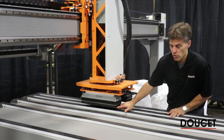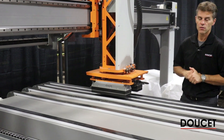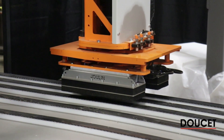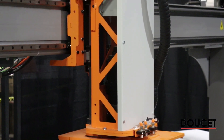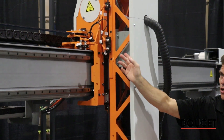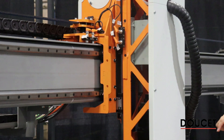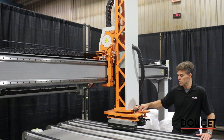We have the vacuum gripping head with our Joulin head — it can grip any type of part in any size. The system self-locates based on the piece sizes, centering as much as possible. Each axis comes with a servo motor. You can see the horizontal drive using a timing belt to maintain position at all times, and the rotation is a direct drive inside the head.